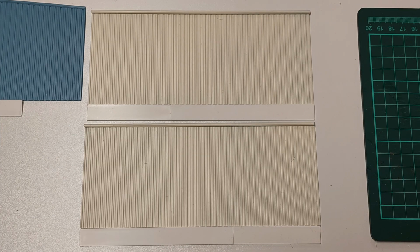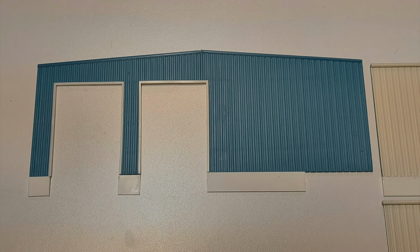In the original building layout, the left portion of the building, or the narrower portion of the building, wasn't the same height as the right side, the larger section, because it didn't have the concrete foundation beneath it. In order for the modified or new single building to have the same roof line, the concrete foundation was added to the section that didn't have it before.